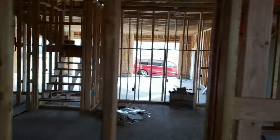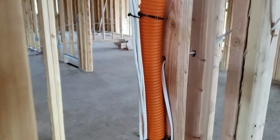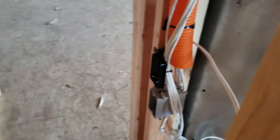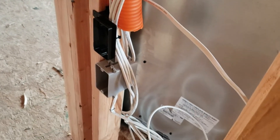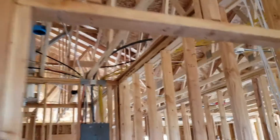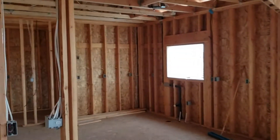Here's a view from behind the living room TV — you can see how I got this conduit run and all my cabling. I took special care to make sure the power wire is on one side of the conduit and the Cat6 and coax cable on the other side. It's behind this low-voltage box so there's no chance of it getting pinched. Taking these extra precautions and little steps like this will greatly increase your odds of a clean install with little chance of noise or interference when everything is done.